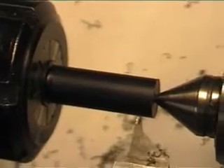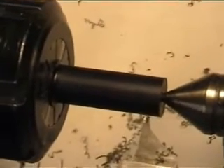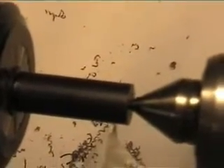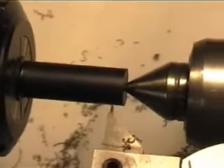Now the diameter of the acetal piece is, I think it's 11.55 millimeters, and I think that should give a nice sliding fit in an 11.6 millimeter hole. Next up is to cut a groove for the o-ring.